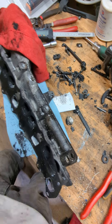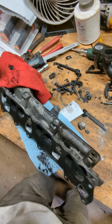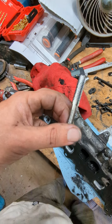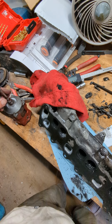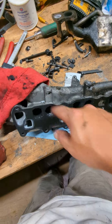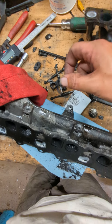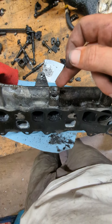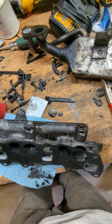Now's as good a time as any because I'm on the last one. If you're poor like me and you don't have a TIG welder to weld these up, there is an alternative. If you get a three-eighths tap — I was going to drill it out but come to find out it was really close to what it's already drilled. The base of these shafts down here is smaller than the top, so you'll measure the top at about 0.35, which is really close to three-eighths. Trust me, put some oil in these holes and just run the tap down a couple times and you're going to get it.